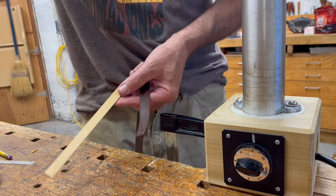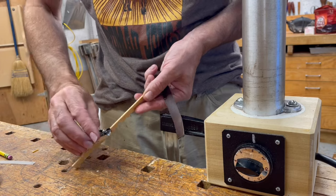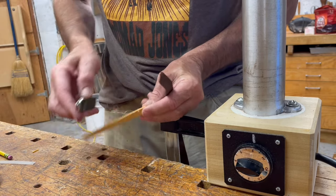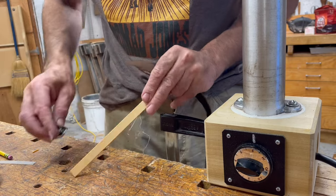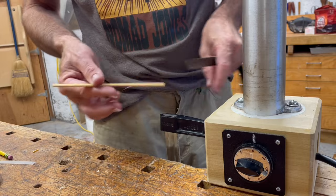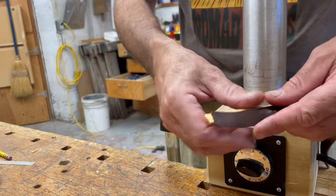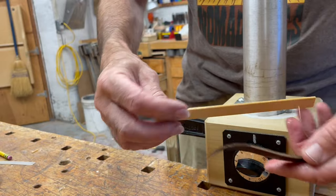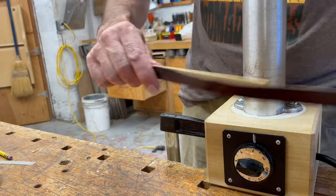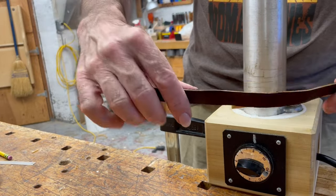And ideally, you've taken the corners off of this ahead of time. I've already done that, but they're a little bit sharp because I decided these needed to be thinned out here. So I lost some of my rounding in that thinning process. Okay, give it another dip in the water. So these have been soaking for a couple of days. I've got this little leather backing strap. And now generally I will start the bends from the ends, depending on the shape of the rib.